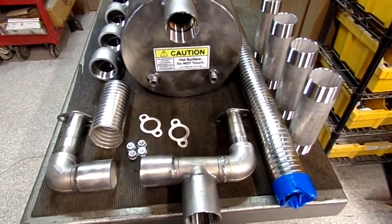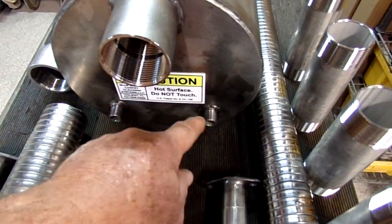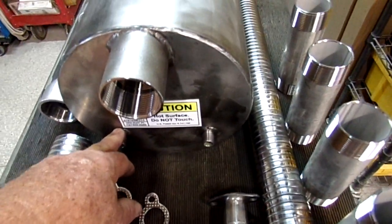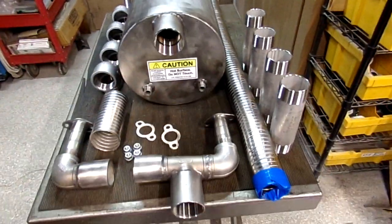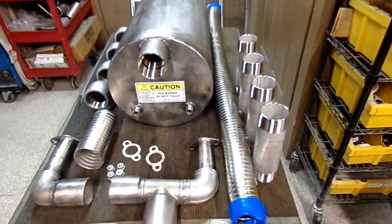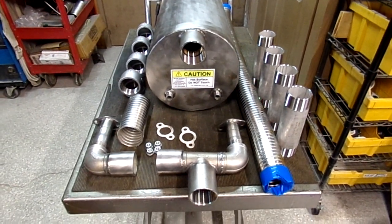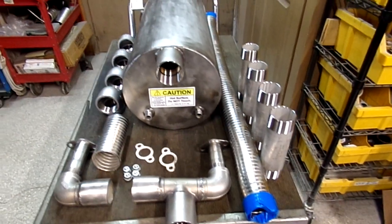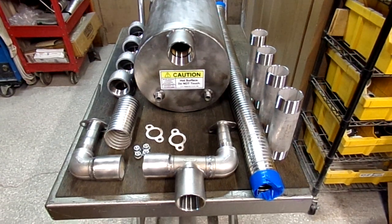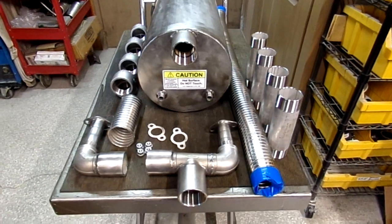And it's an easy hookup. You've got the 3/8 NPT pipe thread for the hot and cold water. It doesn't matter which side you hook it up to, as long as it's in the loop. If you need fittings, we also sell fittings, and we can help draw a diagram for your heating control system for the thermal control to show you how the heater interacts with the thermal control. And if you need plumbing, additional fittings and check valves and thermostats, we also carry that as well.